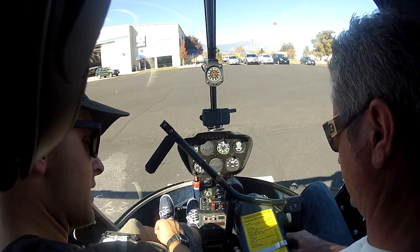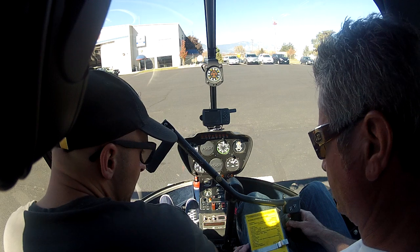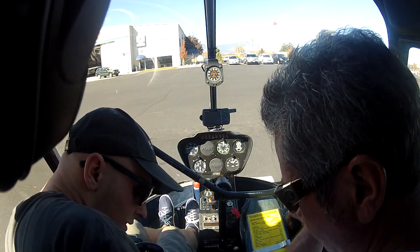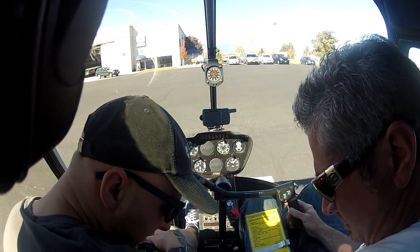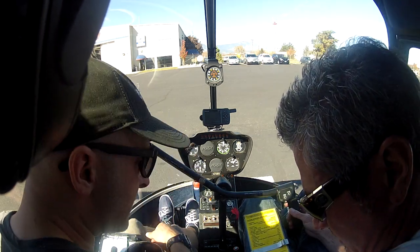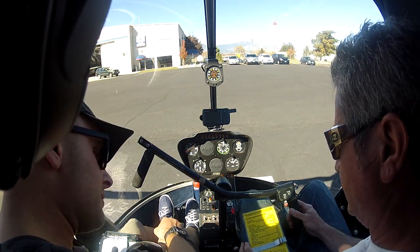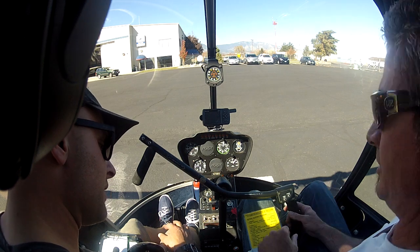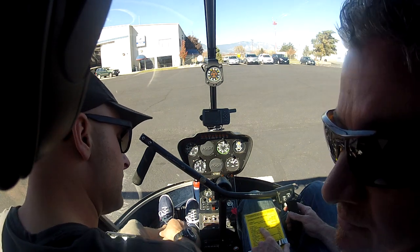All right, next on the checklist, we have frictions back on. So you want to start out. I just turned that on, sorry. Yep. You're good. And then collective, go ahead and do that if you like. That one's kind of tight, so you have to just anchor your fingers and push back with your thumb there. Okay. So friction's on, rotor brake disengaged. That's done. Okay. Fuel shutoff valve on.